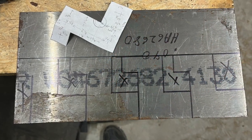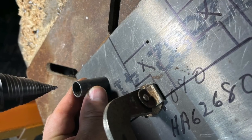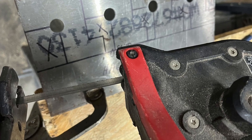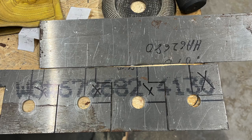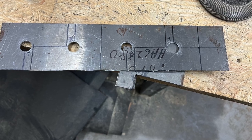Today I'd like to discuss the landing gear brackets. I drew out the best layouts with minimal waste. I drilled where the 5/8 lower longeron would be and then cut them along the lines. On the four rear brackets, I added a lower tab that will bring the pulleys lower for clearance sake. Then the front four were pretty much as per plans.